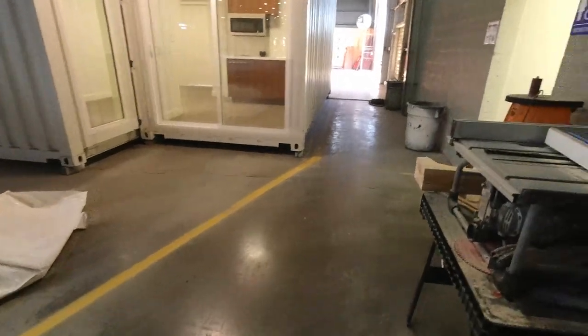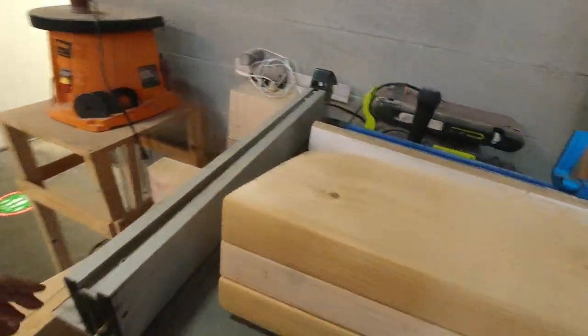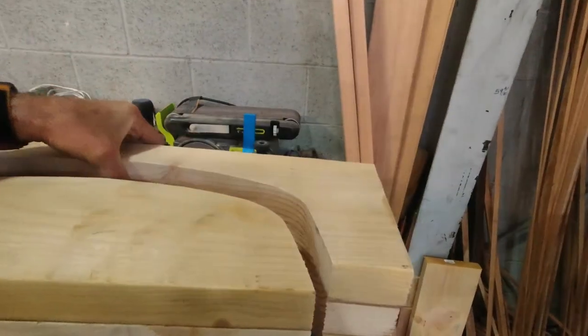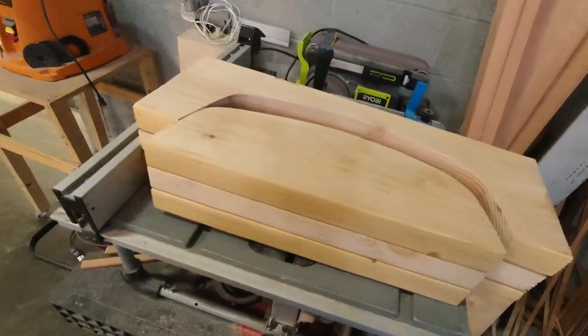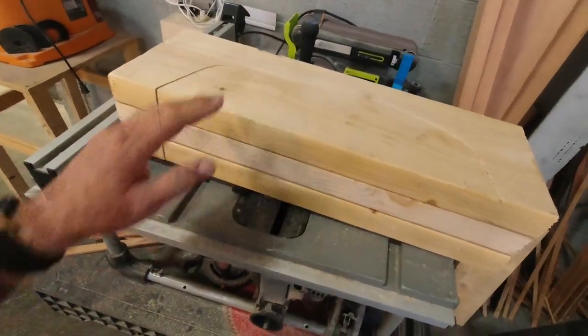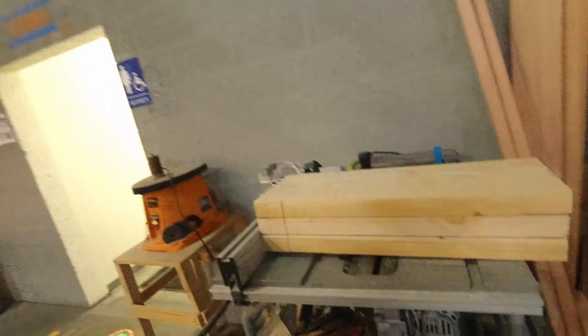What I did is I took the instrument panel and I just made a form — I made myself a form so that I'll soak the sixteenth-inch plywood in water and then clamp it in this structure here, so it kind of takes on this shape. Then I'll be able to use that to actually start constructing the instrument panel pod, I guess I'm going to call it.